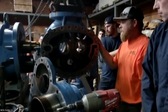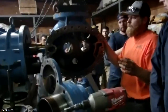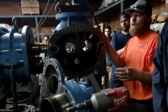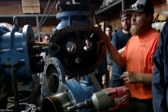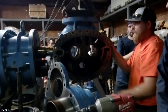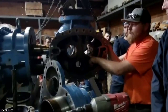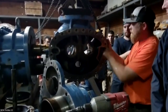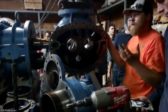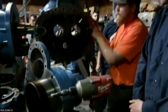Another common thing I see when we knock these sleeve bearings out is something that looks like plastic, almost like a hard plastic. What it generally comes from is the glue on the oil filter caps. You'll get a little bit of that coming off, and it always seems to deposit under these sleeves. There's a little galley in between that will catch it. Sometimes you'll see a piece protruding out of one of the oil holes. I have seen compressors come in where these holes are packed full of O-rings from the oil filter. When guys change it, they leave the O-ring and it gets blown out or whatever, and it always ends up packed in these holes.